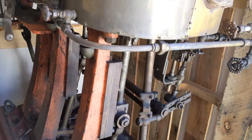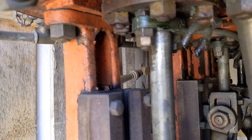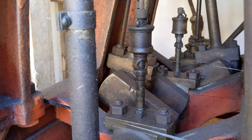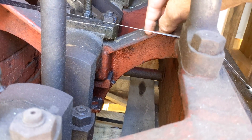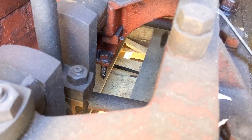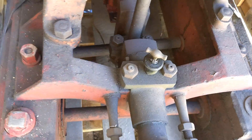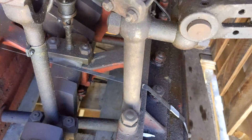Beautiful engine. It's cast back columns, but they're really lightly made — very thin casting. It's very rigid but also very lightly made. You can see the big end bearing for the intermediate pressure is almost touching the frame, so they maxed out the stroke for this engine. The frame is only about a quarter inch thick here, and the webs look like they're only about a quarter inch thick. It looks like there's a supporting foot underneath to maybe support it in the frame of a boat. They're trying to maximize the length of the bearing cap for maximum bearing support of the crankshaft.